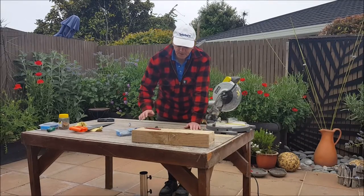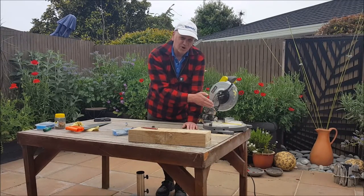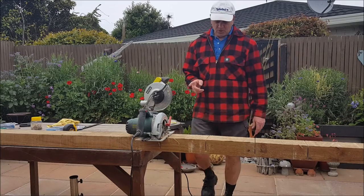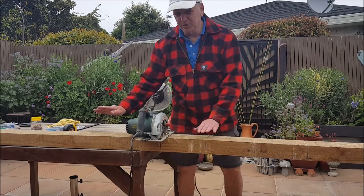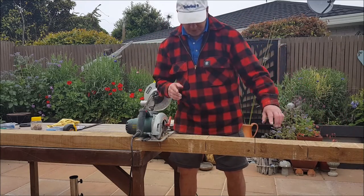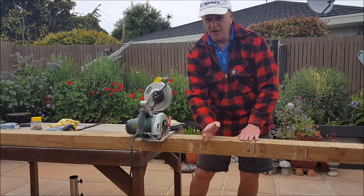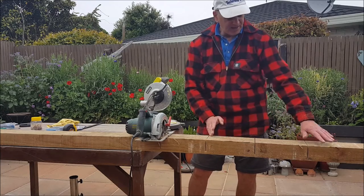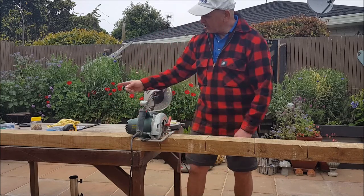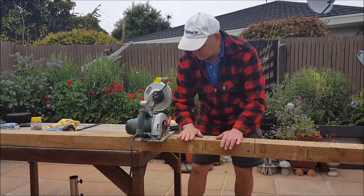As far as cutting them, I found I was using the drop saw and of course the drop saw doesn't go right through — it just didn't cut it, if you don't mind the pun. With the 250mm inserts what I do is use the skill saw; I found it's the best way to go about it. Mark one off at 250mm, run it through the skill saw, put the square on to get a straight line, and be really careful that you get a nice straight line. Then measure again and cut all the way up. Then go down with a hand saw and very carefully cut straight through — it works really well.